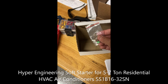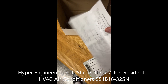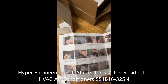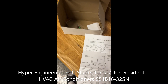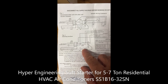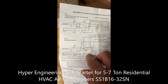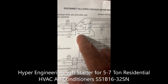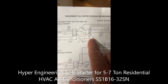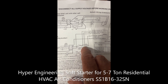This is what we're going to follow for the installation when the time comes. Here's the step-by-step, and on this side we have a diagram showing how it should look at the end of the installation. This is a sample of what you could have today before the install, and this is after the install. One thing I noticed right away is that the wire running from the contactor to the common of the capacitor gets completely removed, and instead it runs from the capacitor to the unit.